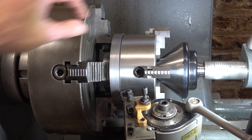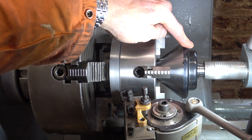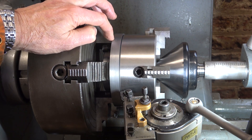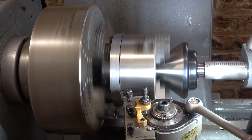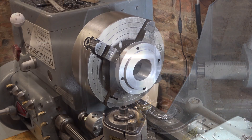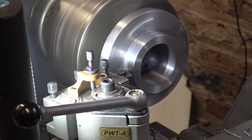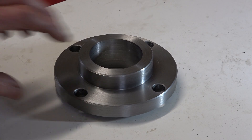The chuck's on, but I couldn't get all the screws tight from here, so I've put this pipe centre in just to hold it all together. I'm going to machine the backplate now to this size. The only thing to do now is to put it in the three-jaw the other way round and clean off the clamping marks from the four-jaw. One finished back plate.